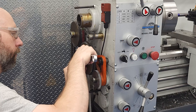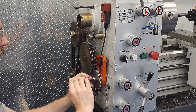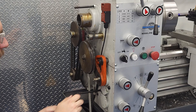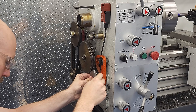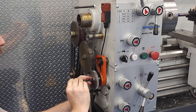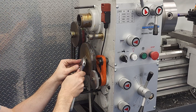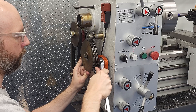The part at issue here is the transposition gear set — that is a 120 tooth gear paired with a 127 tooth gear, which allows us to cut metric threads on an inch lead screw. When you're cutting inch threads, you leave the top and bottom gears both engaged with the same 127 tooth gear, making it a simple idler gear. But when you want to cut metric threads, the top goes to the 127 and the bottom mates with the 120. It varies from machine to machine, but on this one and on most lathes, you just flip the position of the bottom gear and the spacer so the bottom gear moves from the inside to the outside. And as always, for more information, check the manual.